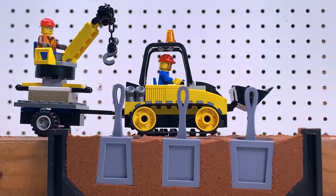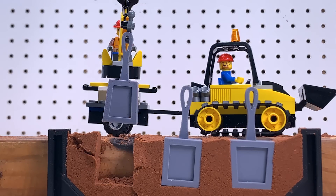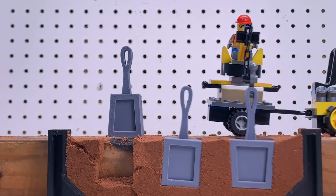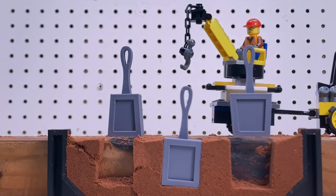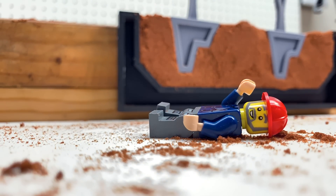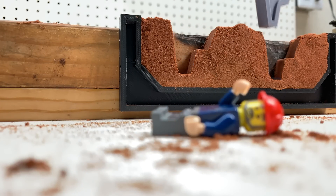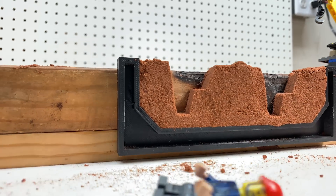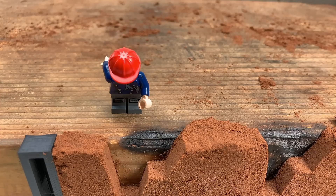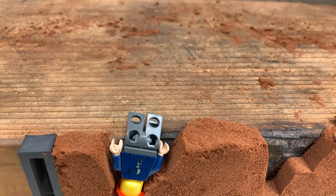When designing a pattern, it's important that it be very smooth and that the sides slope a bit so that it's easy to remove from the sand. It's good to avoid forming sharp edges of sand — instead, use a rounded edge. Grains of sand at the very edge can come loose with the slightest movement.